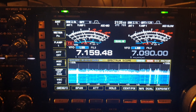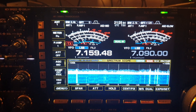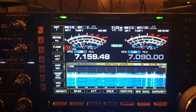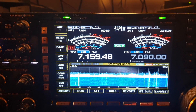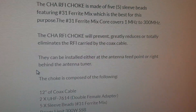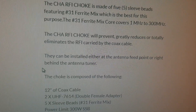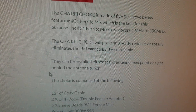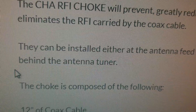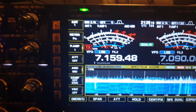That's just a little test on QRM using ferrite beads. I'm a bit surprised because when I put the first one in I thought, oh well, this is useless - but the second one sort of changed my mind. They do say here: if you can feed it at the antenna feed point, or right behind the antenna tuner. Isn't that funny - when I put it right behind the radio, no noticeable difference; when I put it behind the antenna tuner, it made a few S-points difference.